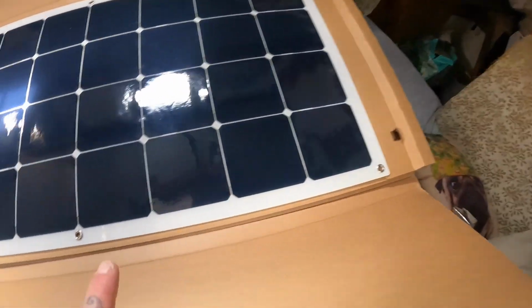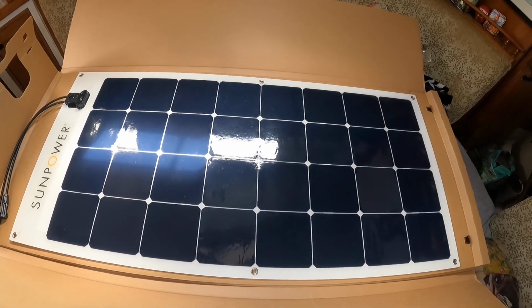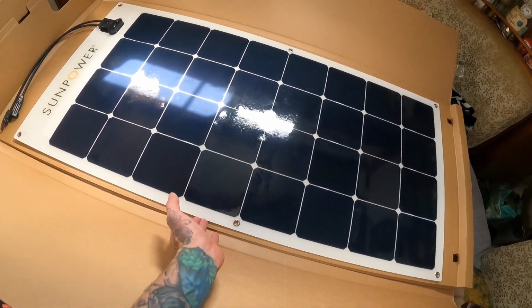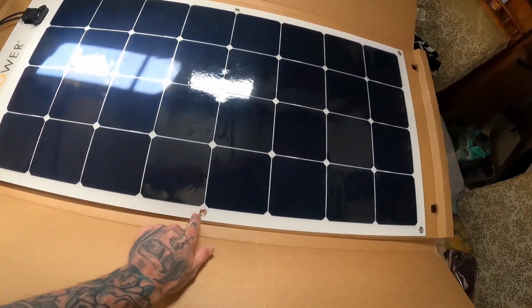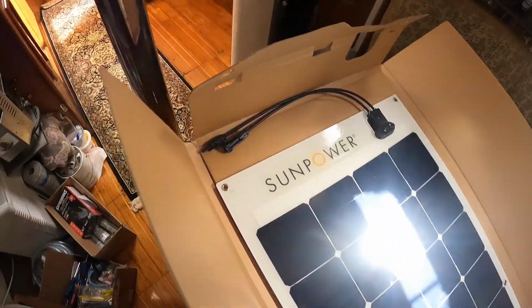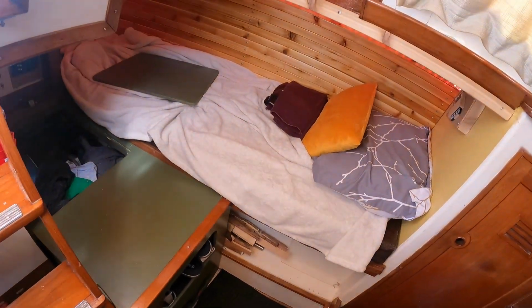But what I like about this panel is the included grommets in the middle, and that's really useful, because one thing that destroys these panels prematurely is when it gets really windy and air gets in between whatever it's mounted to and the panel. These vibrate themselves and it'll crack the cells. So it's nice to see that this company has added these grommets in the middle. Good job, SunPower, on that. And then let's go see what I just did outside. I just brought the panel outside, and I'll show you guys where it's going to be mounted. So follow me on deck here.